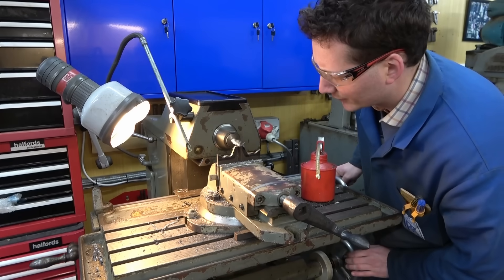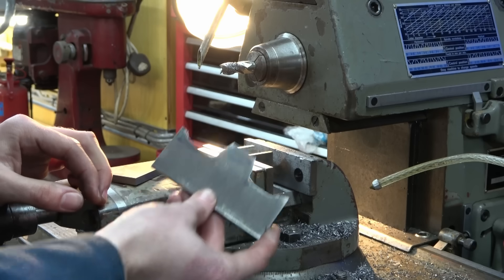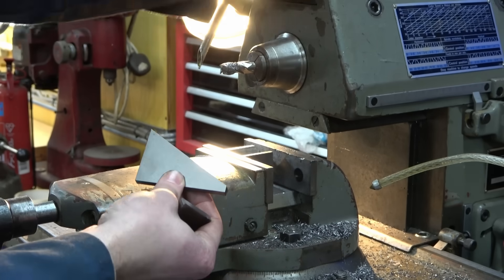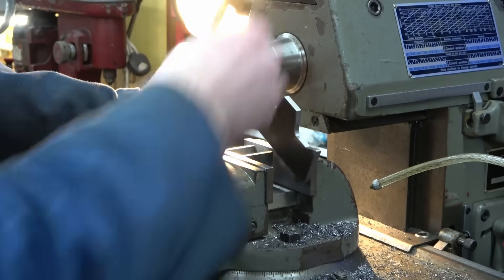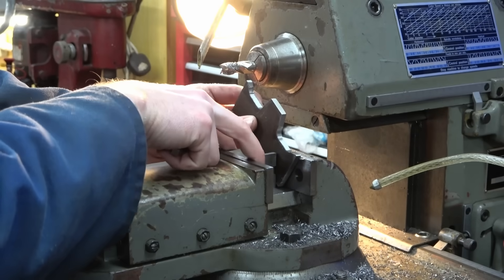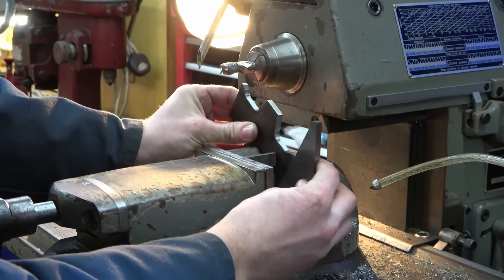There's not a great deal of material to remove here, so whilst I'm working to the lines I'm just using a bit of oil instead of any flood coolant. To complete the four angled sections I'm going to be using two different sizes of v-block to set the pieces in the vice against the fixed jaw. The setting blocks are slightly thicker than the workpiece, so to overcome this I've placed a short v-block in there and I'm going to use that to set the angle and use the v-block as the clamping mechanism.